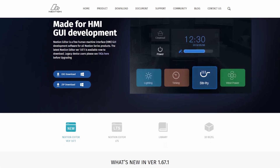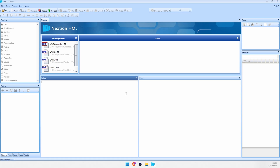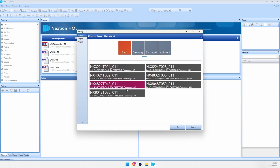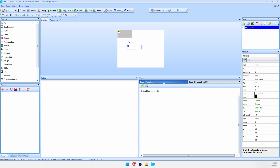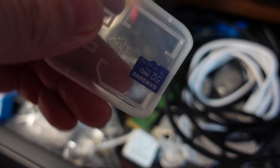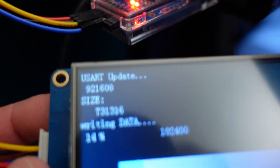To customise the displays I've been making use of the Nextion Editor, which is a little bit janky but it does work. To get started all you need to do is create a new project, which involves selecting the screen type that you have — and if you don't know what screen type you have it is just labelled on the back. Once you've done this you've got a blank canvas the size of your screen and you can start dragging and dropping different components using the WYSIWYG editor. There's a bit of a learning curve but it's nothing too strenuous, and once you've finished designing you can either compile the code to an SD card or just plug the screen in and load it straight onto the display.